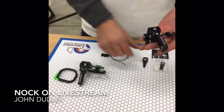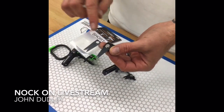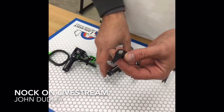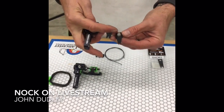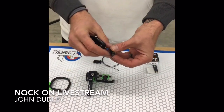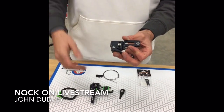You can take the same rest, and it'll come with a bracket that incorporates the octagon blades, just like this. What's awesome about this is these blades fit in exactly the same every time, so you don't have to worry about it tilting or slanting around. The tolerance is dynamite. The set screws on this new one are in the same position as the whale tail. So when you loosen these two and slide this off, you can slide the new bracket directly on, and when you tighten these down, it tightens down on the flat part of that cage.